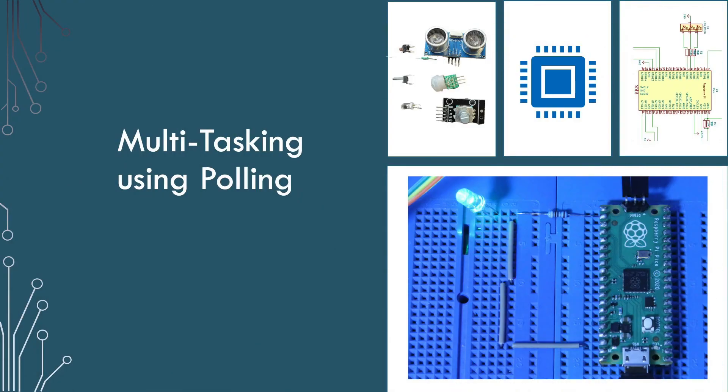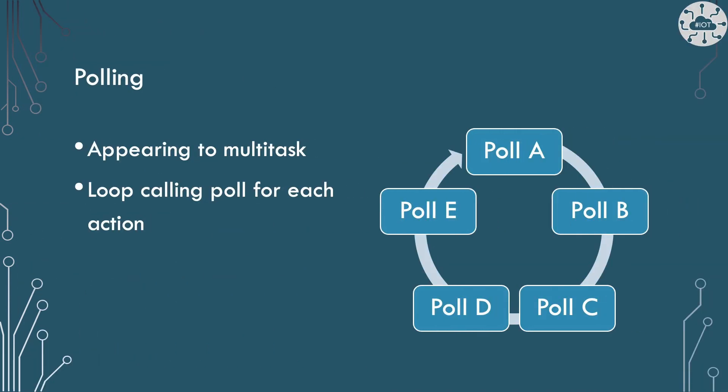But what if we needed to multitask to do something along with the scanner? One approach I'm calling polling here — but it's more fully termed cooperative multitasking. We can appear to multitask by breaking each workload, like KITT Scanner, down into steps, having a poll function that will perform any step necessary for that workload, then having a control loop that calls poll on each of our workloads in turn. The workload must not hold on to control in the poll function but return as quickly as possible. That means we could not use a function like delay to hold between LED illuminations, so I have an approach for avoiding the use of delay in this example.